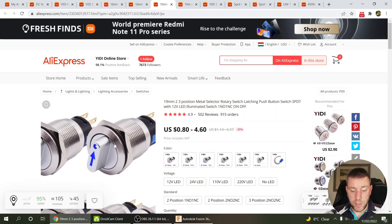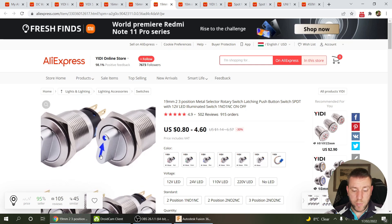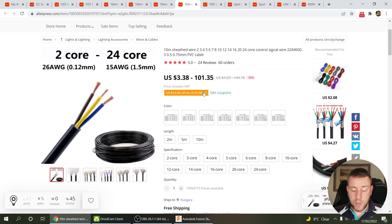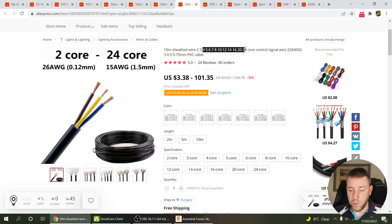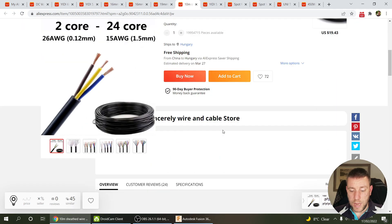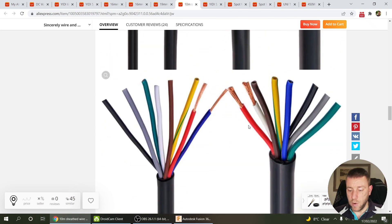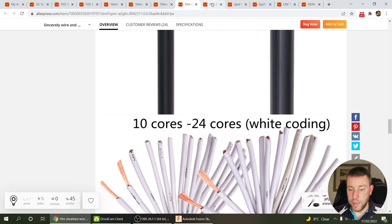There's a similar but different size version — these are 9mm, the others were 16mm. They're illuminated so you can pick the color you want, which looks quite fancy. The reason I bought the 10-pin connector is because I found these multi-core wires that go up to 24 cores, but only up to 10 cores do they come in different colors. Anything more than 10 cores and it's all white. Since you need colors to easily match each end of the plug, I stuck with 10 cores — I think that should be enough.